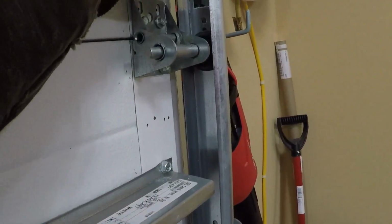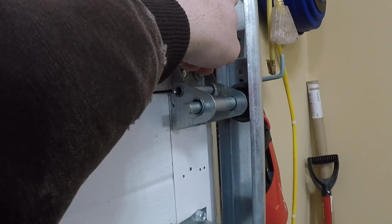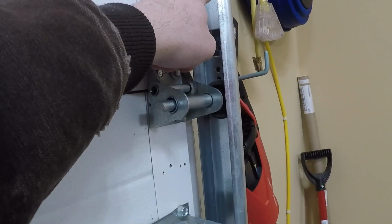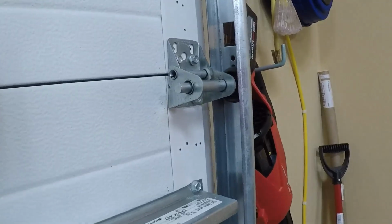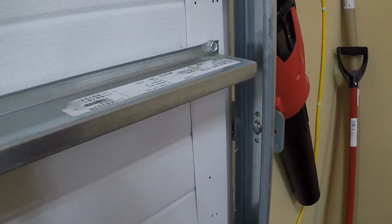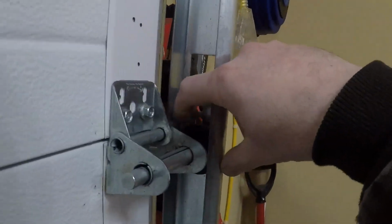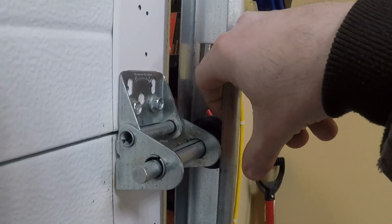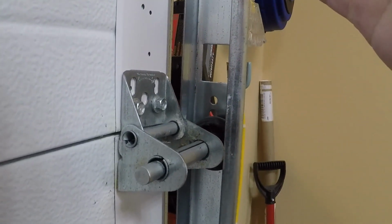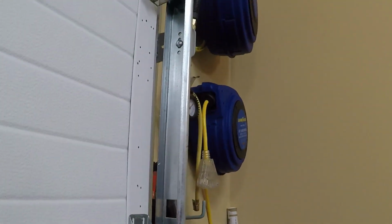But as far as on here, like I said, if you put a lot of lubrication or grease or anything on here, all it's going to do is collect dust and make a mess. It's going to get nasty and grimy over time, and it's just going to make the door not only louder, but more rough riding. And also, as you're going through here, make sure that all these bolts are tight. So take that WD-40 and give the whole track a really nice cleaning top to bottom, and it's going to give a really nice place for the wheels to ride on, because these wheels do not need lubrication. They basically just ride in here as a dedicated road. Just like your car on the road, you don't need any lubrication underneath your tires. Same thing here. As long as this is nice and clean, it's going to help keep the noise down and give it a nice, smooth ride.